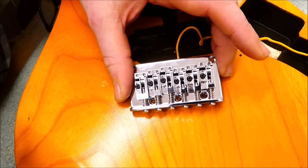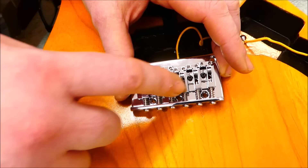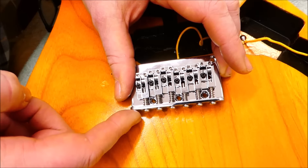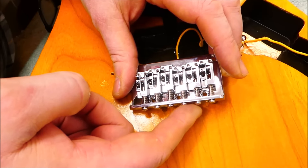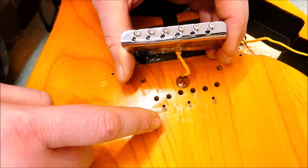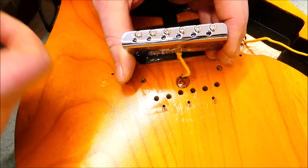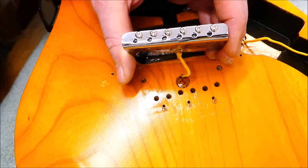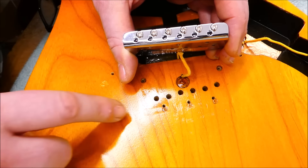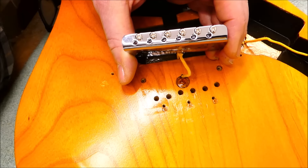I'll just call attention to something here. I got the two screws at the front installed, and then I was sighting down the ones at the back of the bridge and something seemed funny — I couldn't see holes, just indents for a pilot drill. For some reason, the holes in the original bridge are a couple of millimeters forward of the new one. But strangely, the guitar has been punched for the spacing of the replacement, which is very nice of them. I just have to drill them out, and I really should fill the original holes first so they don't wander or break out.